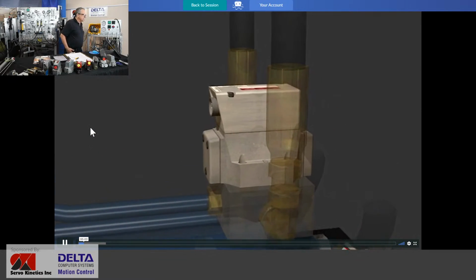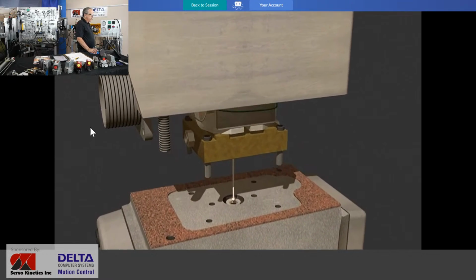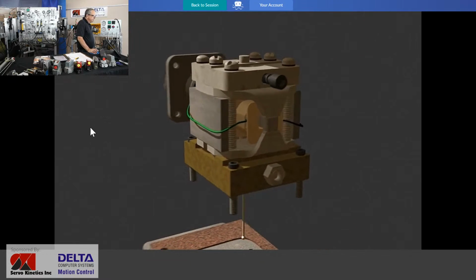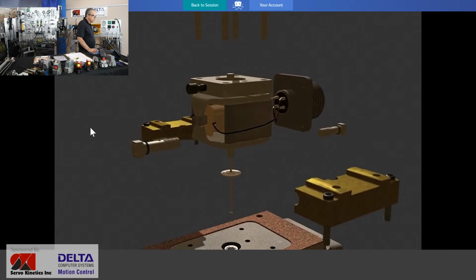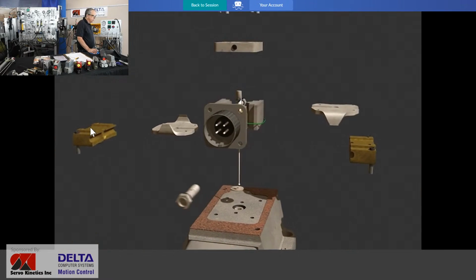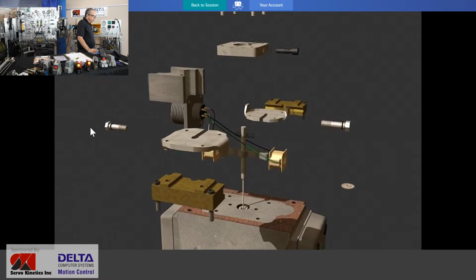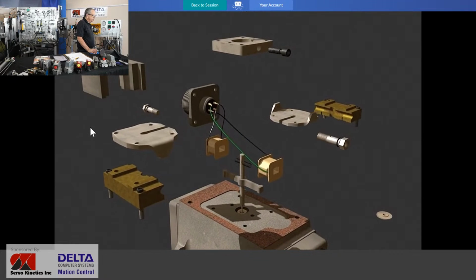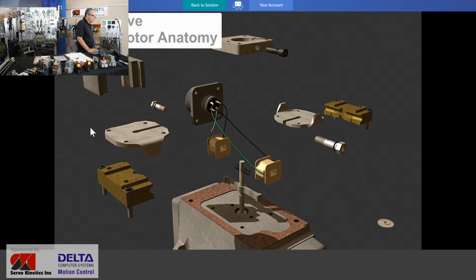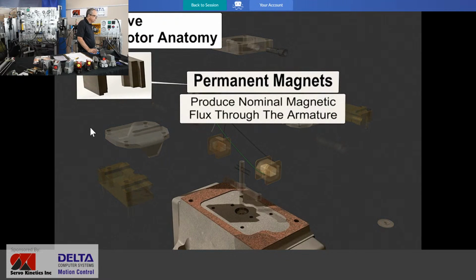Let's zoom in on the inside of a two-stage flapper and nozzle style valve with that Swiss watch torque motor up on top. There you see all the pieces flying out and orbiting. That bronze nozzle block is not two pieces. We split it in half just for clarity. Otherwise, everything else is as it should be. We cut that nozzle block in half so that you could see inside better what the passages are like.